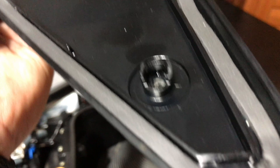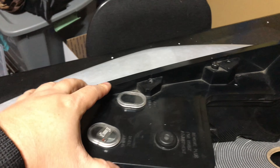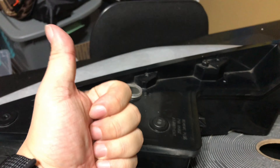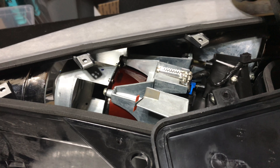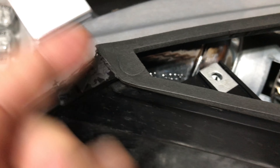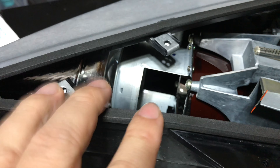It'll be a little tough on some of the joins where I can't turn the foam, but the foam mounted and stuck on the top lid, then compressed against the foam here, should create enough of a watertight seal to hopefully prevent water from getting in — water vapor and condensation as well. I also used some black sealant to kind of glue the foam piece down in place.